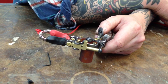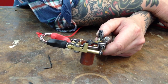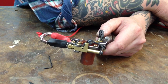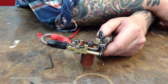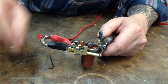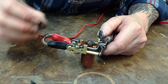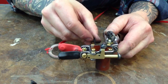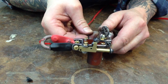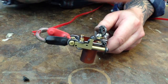When you get down to lower voltage, this one's tuned up pretty good. But say you got the machine and it ran too hard for your liking — the easiest thing to do would be to adjust the spring tension. So I'm just going to turn that in just a little, and you can hear it gets softer — it's not hitting as hard. But it also gets mushy and now it's kind of stuttery.